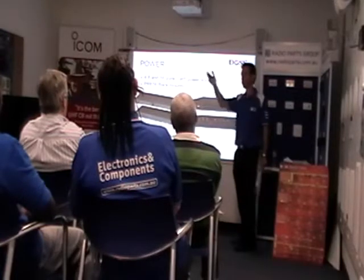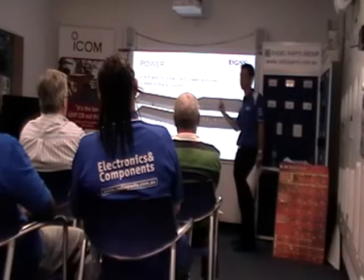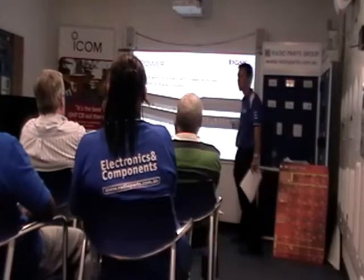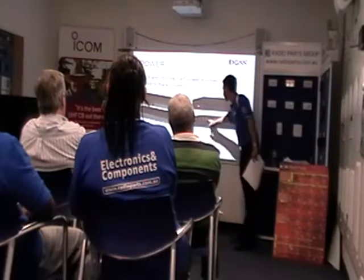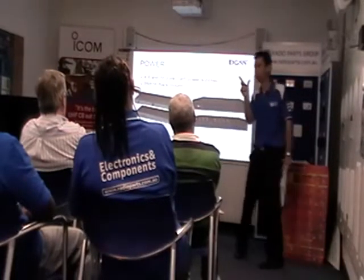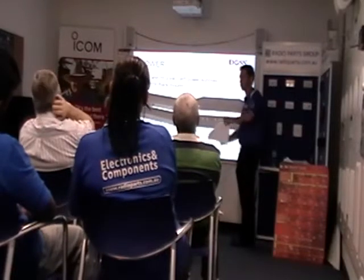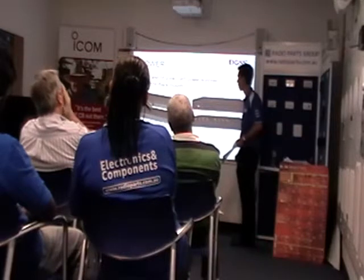You run the Cat5 to the cameras. You're going to need baluns, of course, on the other side, which I'll go into in the next slide, to convert it back, or to separate the video and power. It does come with a balun. And also then you've got your video outs in the unit, and it comes with just little fancy jumper leads, which then you just run into your inputs of your DVR. So you simply have your DVR and your power supply in the one situation. They've been quite good. We've sold quite a few of them, haven't we? So they've been running quite well.